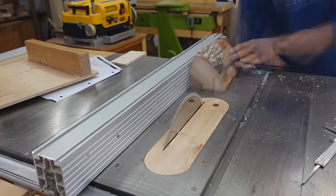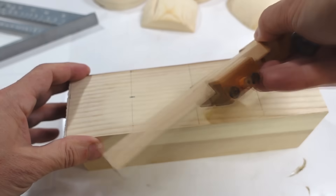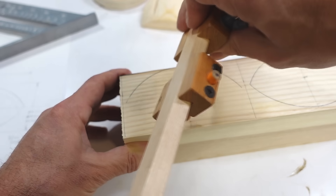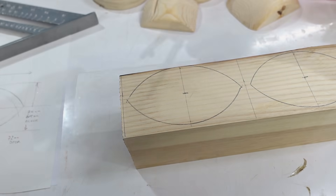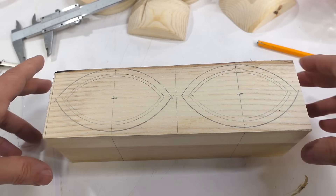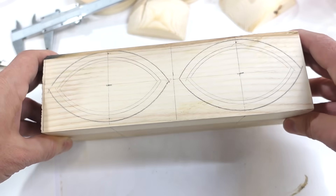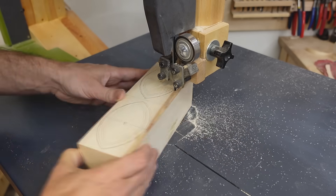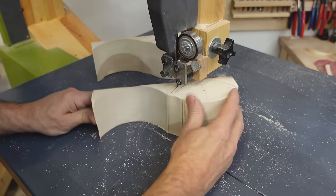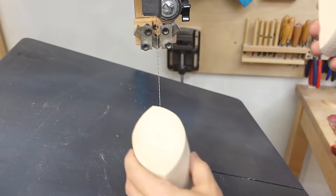My starting blank needs to be 70 by 72 millimeters. My piece of wood is just big enough to cut out two of those double blanks. The first thing I mark is the radius for the overall extent of the pieces, then where the bevel cut is going to go, and another smaller arc for where I sand to — marked on both sides, and it's important those two are aligned, otherwise the whole thing will be skewed. Then I cut it out on the bandsaw, and this cut isn't tricky yet.